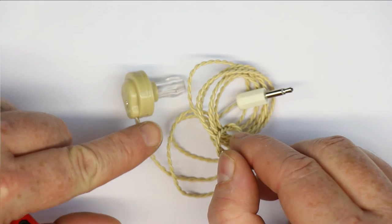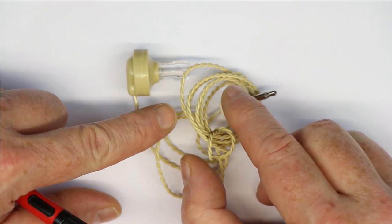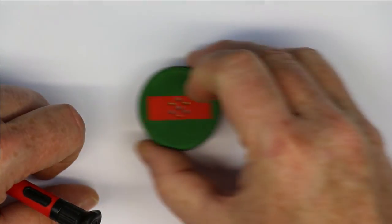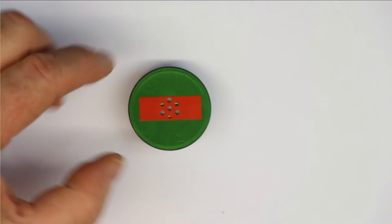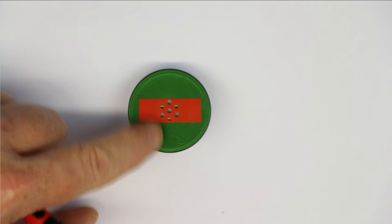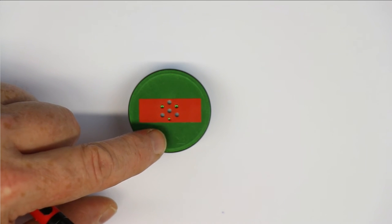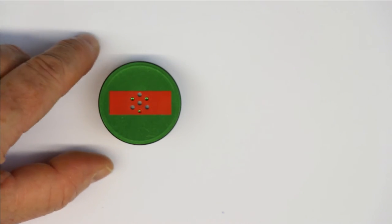I already showed you in another video that crystal earpieces are one of the most sensitive earpieces you can get, and we also sell them as a very good alternative, or even the second best alternative. And then there are these so-called balanced armature transducers, which have the absolutely highest sensitivity, but they have one disadvantage. They are relatively low in impedance. This one here measures only 150 ohms, so even if you put two in series. But anyway, they are so sensitive that even with their slightly too low impedance, they are the absolutely best, most effective and most sensitive listening devices.